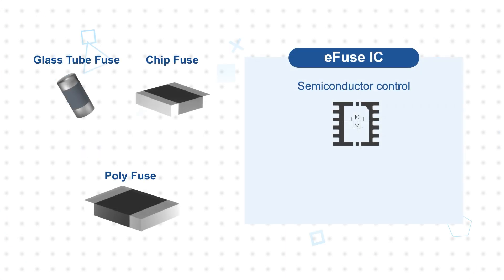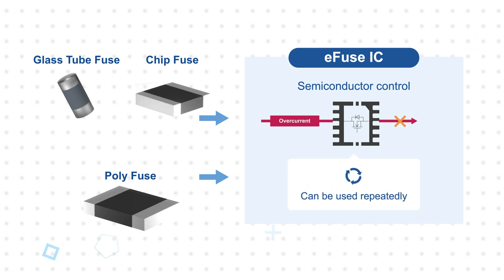The TC-KE9 Series E-Fuses offer many advantages over other fuse options. They provide more protection functions than standard fuses, and their resettable nature reduces maintenance cost and downtime compared to one-time fuses. The MOSFET-based operation allows for rapid shutdown and precise, repeatable operation with a current limiting response time of 80 microseconds and a short circuit response time of just 2 microseconds.